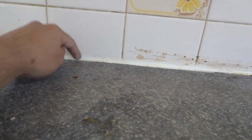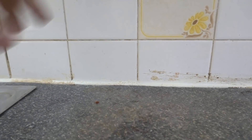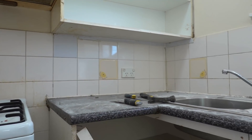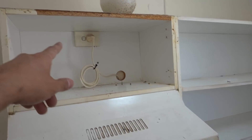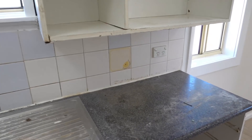So then you can disconnect your plumbing, cap it all off, and we're going to start removing our sink. You can see there's screws or brackets all the way around that clamp this all down, so basically back that off and we'll be able to remove it. With the benchtop we've also got L brackets around here, plus if you have a look at the trim up on top, you might find a couple screws that actually hold down the bench as well. So we're going to remove that, cut out the silicon or caulking down at the back, and remove the tiles separately. Now with the power points — especially depending on which country you live in, here in Sydney Australia you need to get an electrician to disconnect all of those for you.